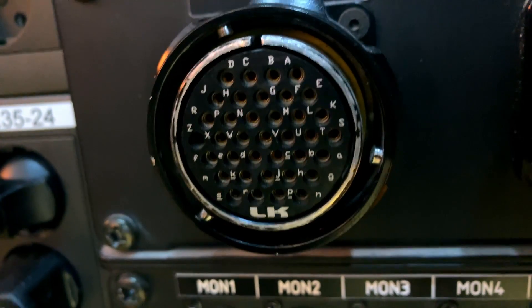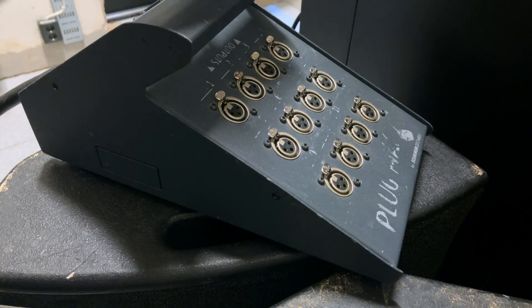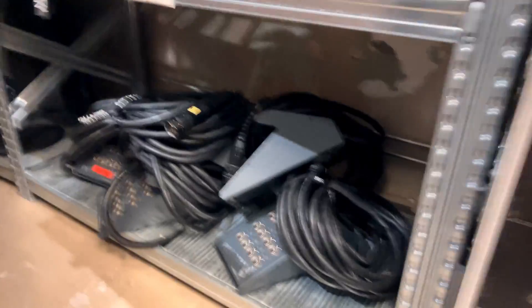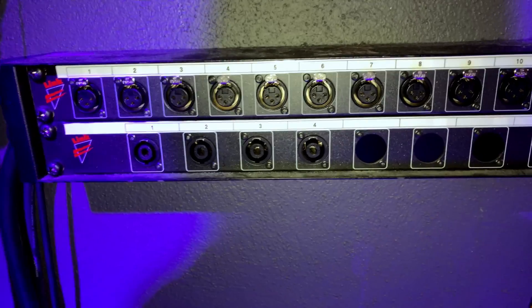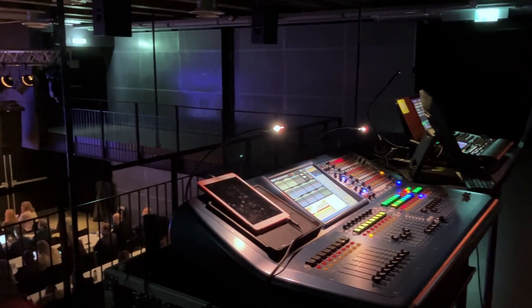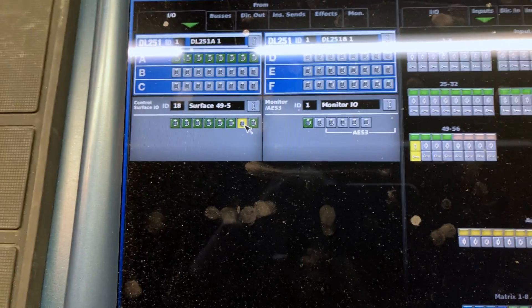You can do the same on the other side — a breakout box or even an input directly into your mixer. When you screw that in, it creates a continuous connection so that each XLR connector on one side goes all the way down this multi-core, through the multi-pin connector, into the multi-pin connector on your mixer and transfers those signals to a channel. Why do you want to do this? It's a lot quicker. If you've got a stage box on one side, you connect different instruments to that stage box, go down your multi-core, and at the mixer you know that stage box goes into channels one through 12 or 24 linearly. Why not just have this pre-wired connection into the mixer that you can just screw in? Then you know stage box one goes to inputs one to 12.